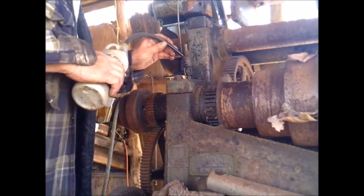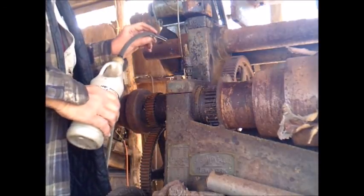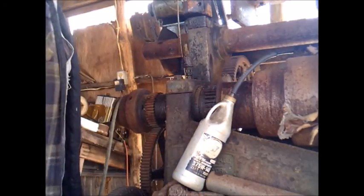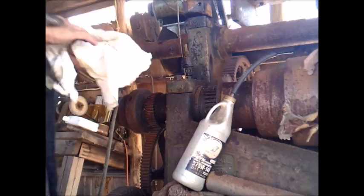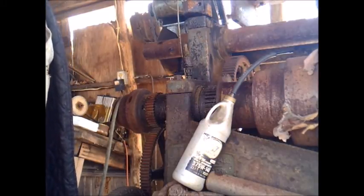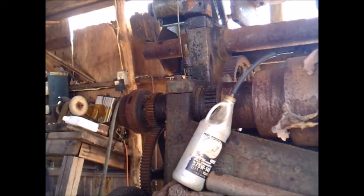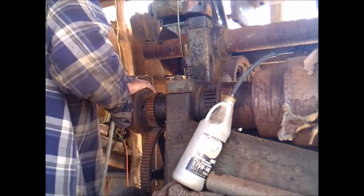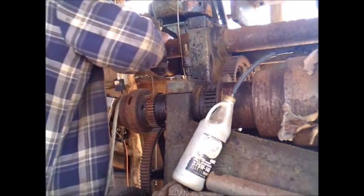It's got a 480 volt, three-phase motor on it. It's kind of hard to get three phase down here in the woods, so I tore the motor apart, took the windings out of it, took the fan off of it, and had room enough to put a pulley on. I made me a bracket back there on the back that's got an 18-horse Briggs and Stratton sitting on it, and that's what I use to turn stuff with. See if we can get it fired off here.